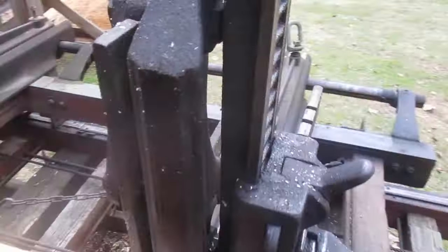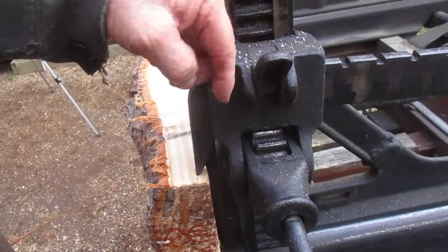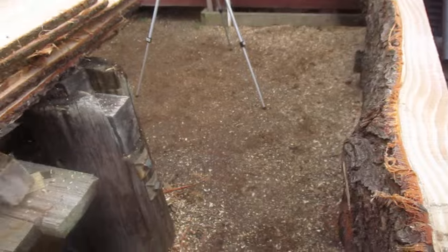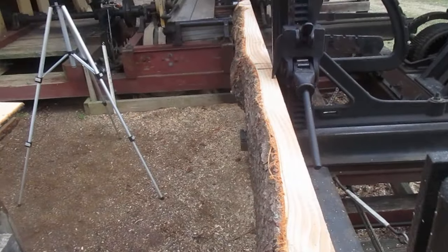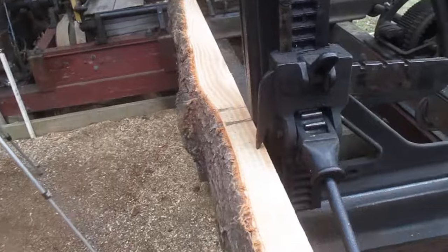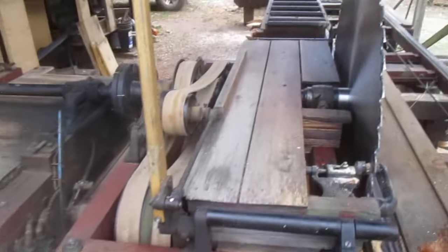These dogs go in at a taper, which is why I hit one of them a while back. See, instead of going perfectly straight because there's so much play in it, it tapers. So you might have clearance up here, but because of the angle of it, it caused me a little bit of a problem. I did a video where a near fatal accident hit the sawmill. I was right on here, but the lower part polished off some of the blades, some of the teeth.